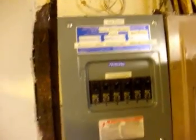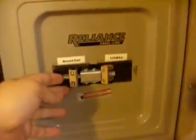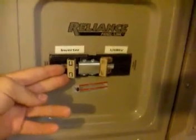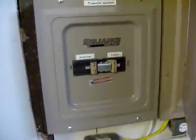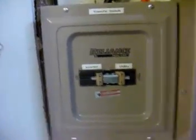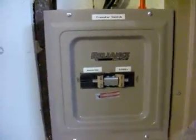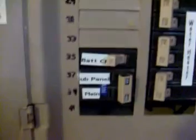In the event you don't have any wind or sun for many days, or if you want to do maintenance on the system, you can flip this switch and anything on this sub panel will go back to utility power. That's a good thing — if anything ever happens for any reason at all, you can't upset anybody in the house because they're always going to have power.